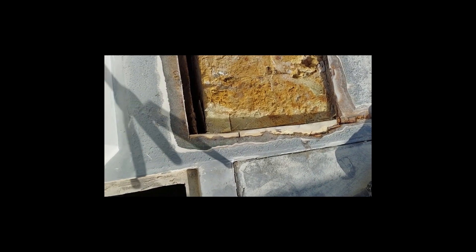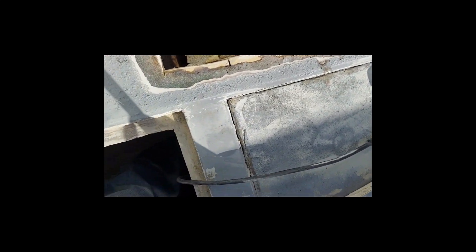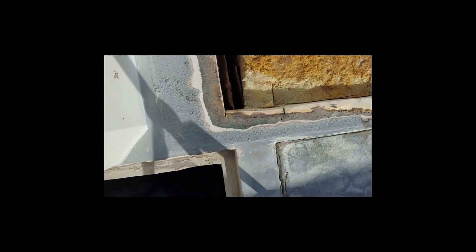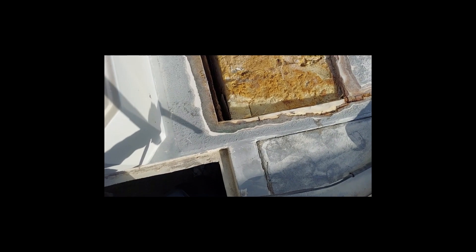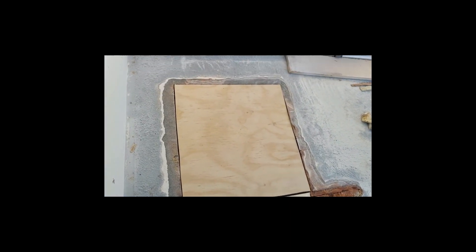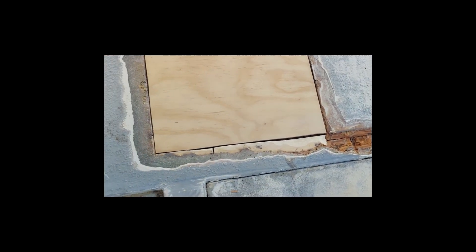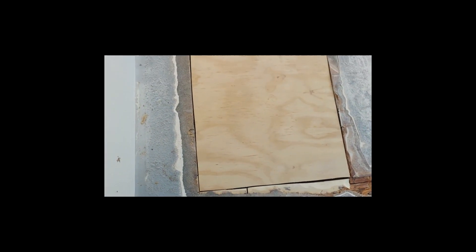What I've done is cut back — there was a crack going further back. I ground that back and I've ground the edge around the hole a little larger. Now I'm going to cut a piece of plywood and start putting some fiberglass in. Cut a piece of wood to put in the floor, did a little grinding underneath, and I've got a void there that I have to repair. Next thing is get the resin out and fiberglass and start putting in the patch.